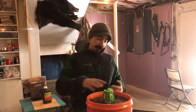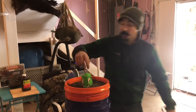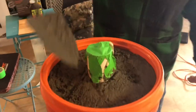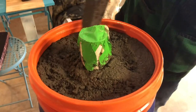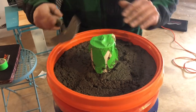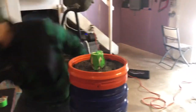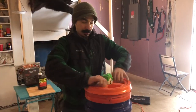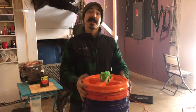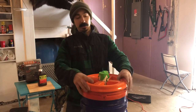Concrete is in and filled to the top. A tip: cover the PVC bearing pipe as you pour so concrete doesn't go down your bearing shaft and cause problems. The mix is nice and thick, not too soupy. Pack it in well. I taped off the threads, then screwed the top lid on to keep everything straight, gave it a final shake to settle, and now we let it cure. Sackcrete says 30 minutes, but I'm leaving it standing for quite some time.